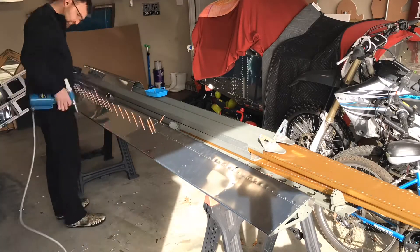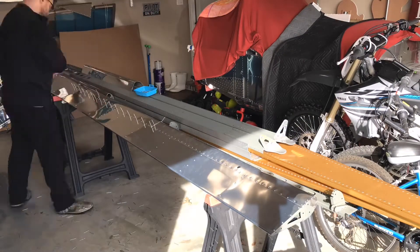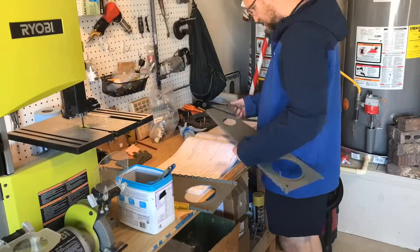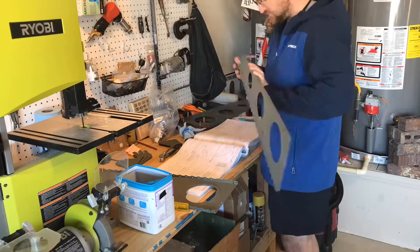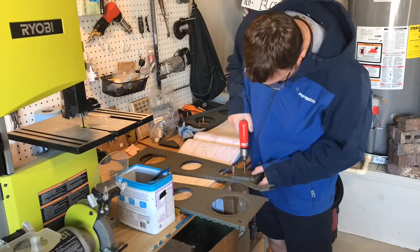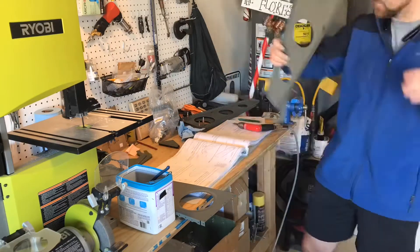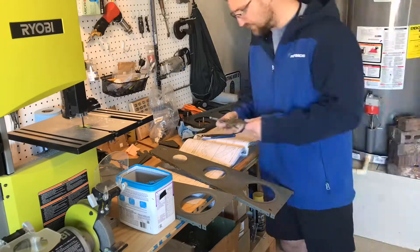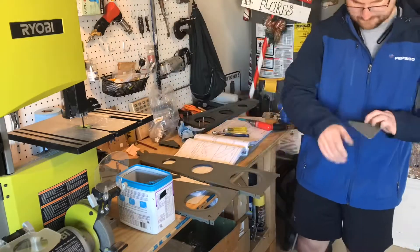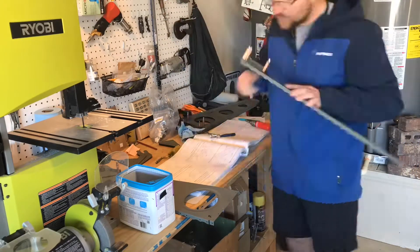As I'm recording the audio on this it's Friday — the first day above freezing, really starting to get everything thawed out. Here we are working on the hinge assemblies, getting those match drilled to the ribs for both of the wings. Pretty simple process — it's just making sure you have all the right parts, lining them up, getting them attached to the right ribs, and getting everything match drilled and then final drilled.